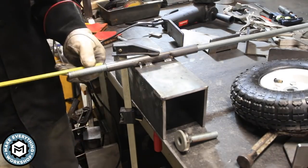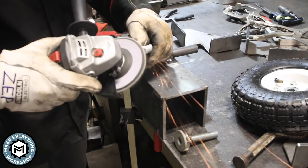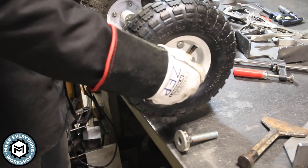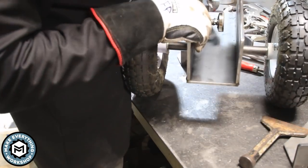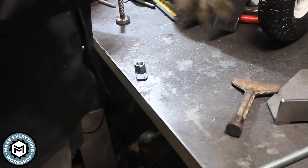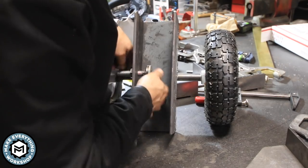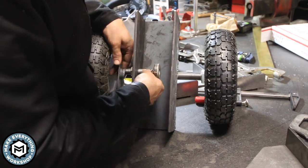I clamp the little follower on and push my axle in there, get a wheel on there, measure the distance, mark that on the other side, and clip it off with the bandsaw. Then I deburr the ends and start to bolt this thing up — making sure everything fits nice, then going back in with some Loctite. I also wanted a nice way to tighten this clamp, so I took a little piece of one inch by eighth inch flat stock and welded another 5/8ths nut to it, using my chisel as a third hand. What this gives me is a tool-less handle I can screw on when I want, thread it back out when I'm done — it bottoms out and locks itself in really nicely.